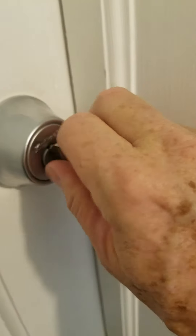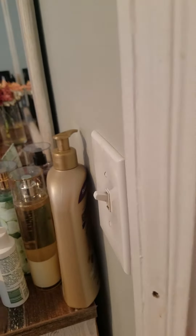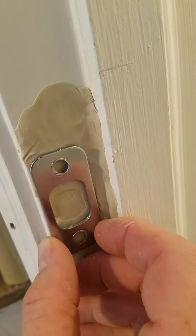I make an impression in the plumber's putty with the deadbolt, then pull it back and you can actually see it — see the impression. Now you can line up the striker plate to it, really get it in there where you want it.